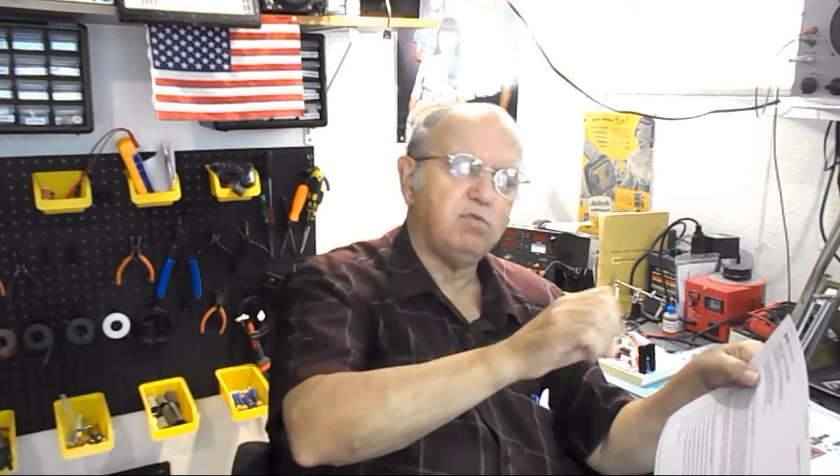Rogers didn't do anything with it because he already has a really nice NC240CS commercial version tagged as an airport receiver. Those NC240Ds are pretty good performers — they have the best features of the catacomb receivers. It's called a catacomb receiver because the entire tuning unit down below is on a track, and when you pull out the knob and turn it, that changes the bands. They also have a really good crystal filter that actually works, and when aligned the dial readout is pretty good — kind of vague, but good for an analog dial.